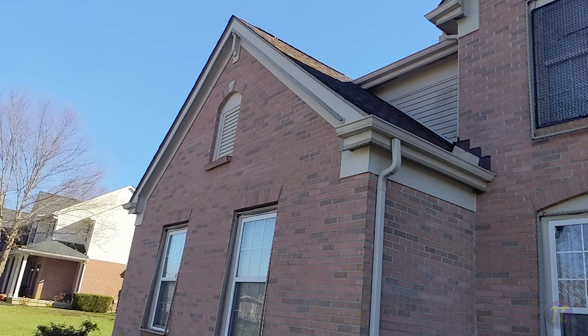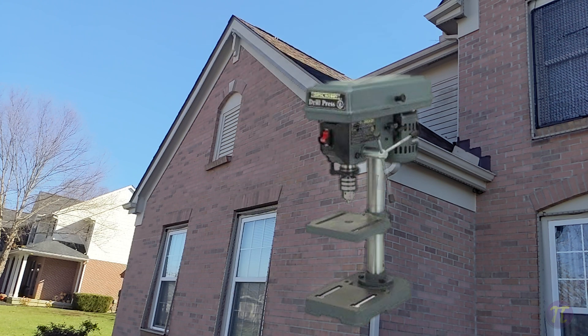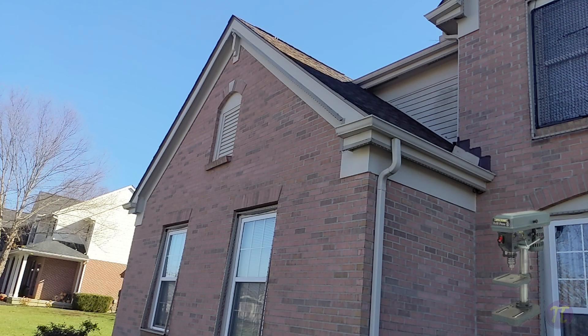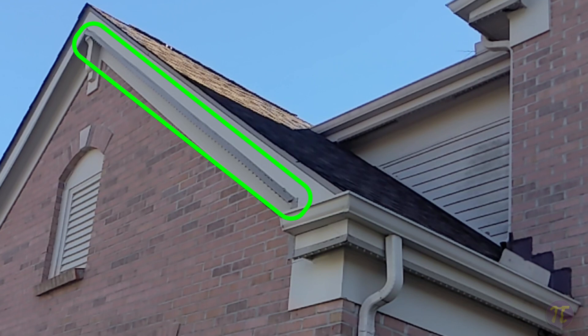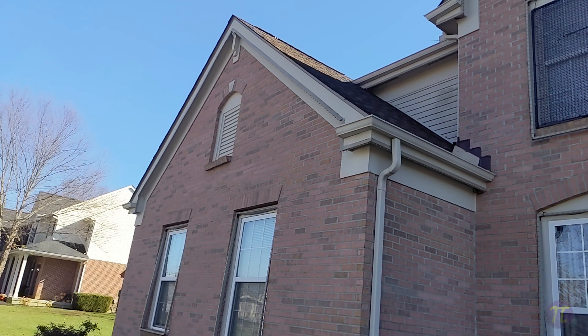We built the roofline and the window frames with vinyl J-channel. We talked about this in an earlier video, but we used a drill press to space the bullets every two inches. I purchased an 11-millimeter drill bit, which is just enough clearance for the bullet pixels to hold snugly without constantly falling out. The J-channel was then secured to the fascia using stainless steel screws. Zinc screws eventually corrode over time, so I decided to spring for the stainless steel. I also chose to surround the drill points with silicone.